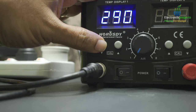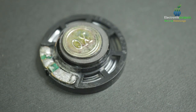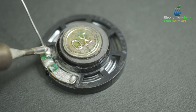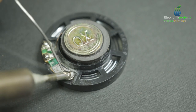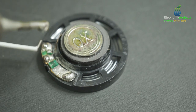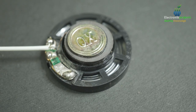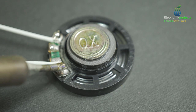The sound with the Arduino Uno is generated by pulse width modulation, wherein the analog waves are constructed with a square waveform — that's how sound is generated. We will first solder the wires onto the speaker pins, and hookup wire will be the best option so that you can insert it right onto the Arduino Uno PCB. Let's solder these wires on.